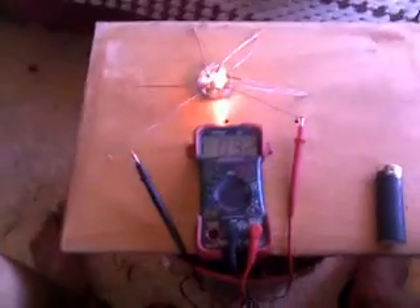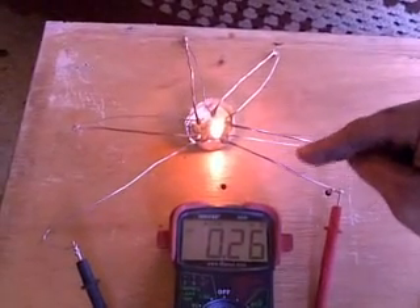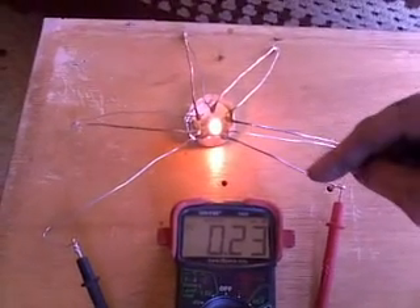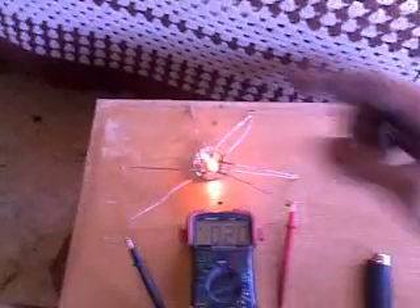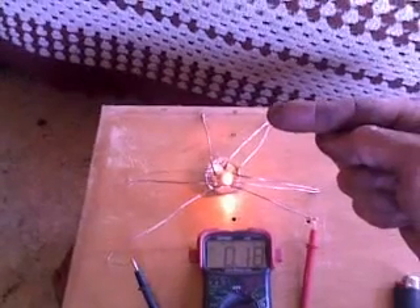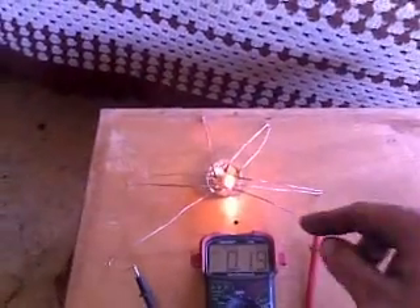So there's a brief demonstration on how to build electricity just through hot and cold. You could use any size copper pipe and aluminum pipe connected together in the same V design — you'll get much more amperage because of Ohm's law, your current will be higher. You can make a doily of these with the center junctions poking inside a wood stove pipe, and cold air on the outside of the house — you could have a whole series of these going down the wood stove pipe generating power for you, made on your own.